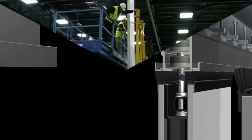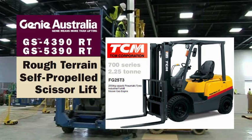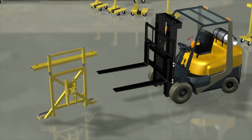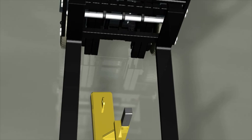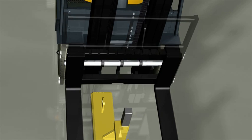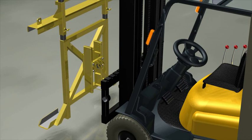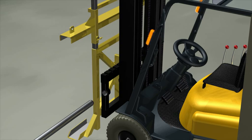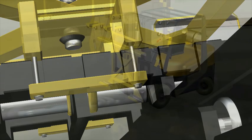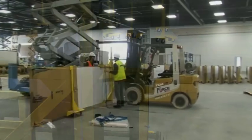Check with the hire company that the forklift is compatible with the lifters. To attach the lifter, the tines and backguard are to be removed. The main bar across the front is to have a 60mm OD. Remove the 60mm OD bar, position the lifter's rotating head into the line of the 60mm OD bar, and reinsert the bar. Ensure that the bar is fully tightened and secure. This now locks the lifter to the fork or manitou.